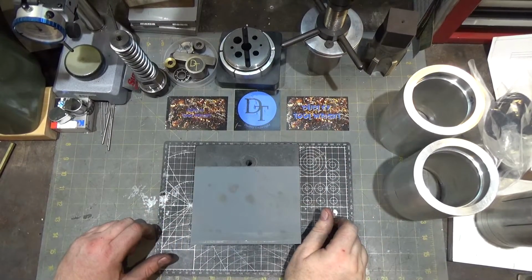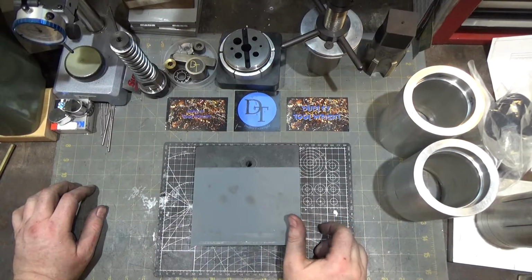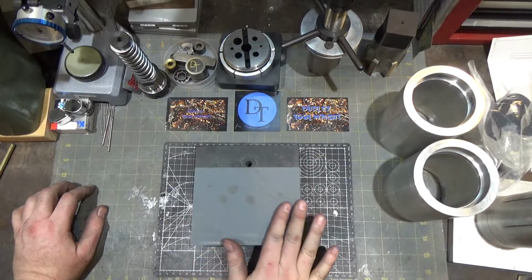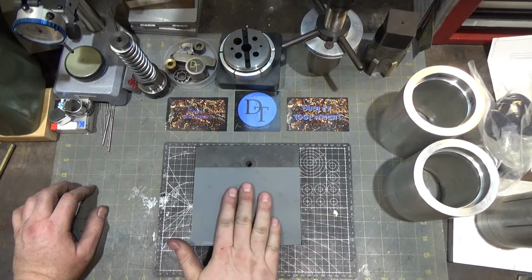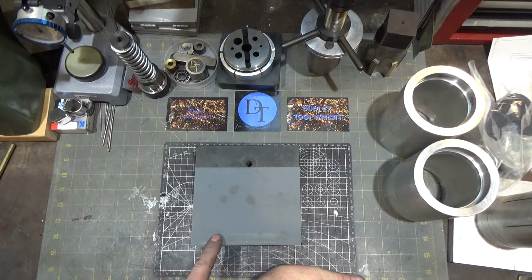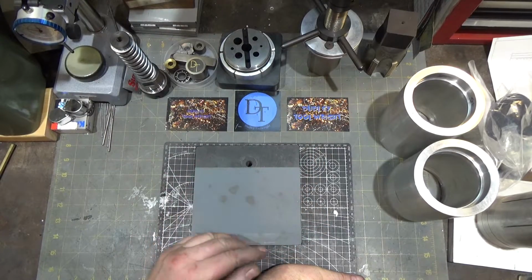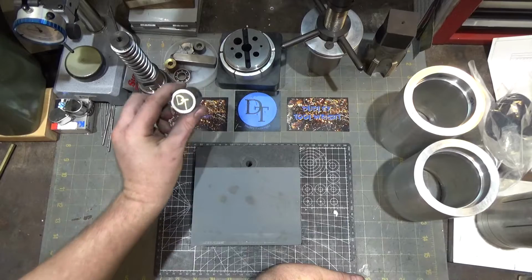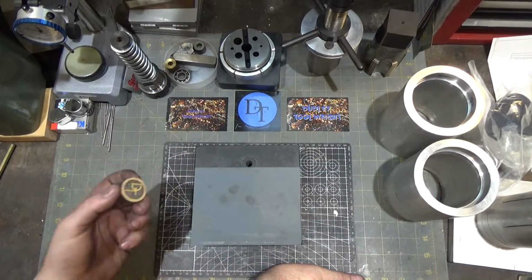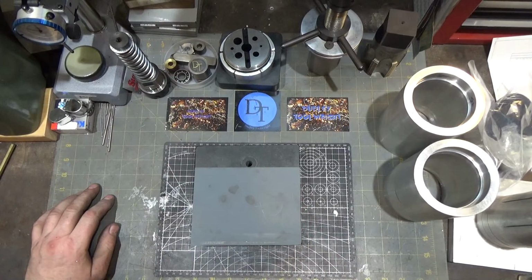Continuing along the sanding vein is this idea from Tom Lipton and Robin Renzetti. And this is some adhesive-backed sandpaper. This particular stuff is 3M, and you can tell that I did not clean it perfectly before I put the paper down because there's a couple of bumps here. But the beauty of having a very flat surface and sanding stone is you can take something you're just working on and give it a quick polish on here. And I keep some lubricant over by it, so it's pretty handy to have.